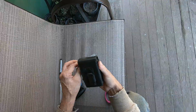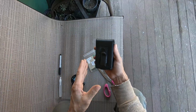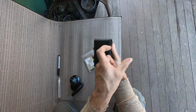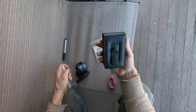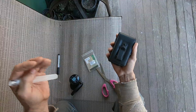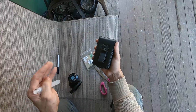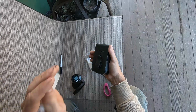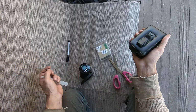I wish they would have had a little bit of frequency options for the different programs. Like, let's say for program 1, you can adjust your frequency bandwidth, right? So you can't do that right now. Hopefully they can come out with an update that you can adjust your different frequencies for that program, right? But I understand that each frequency you have to have different settings, and I realize that with the Deus One, once you adjust your frequencies, you have to adjust your ground balance, your reactivity, sometimes your audio response, and I always have my silencer at 0 anyway.